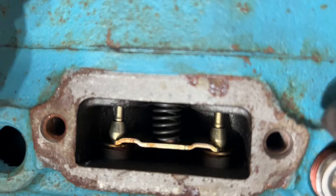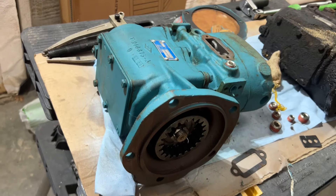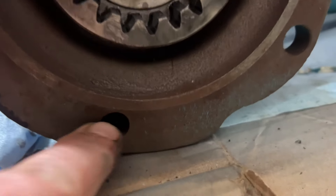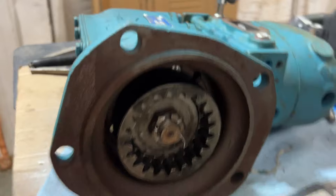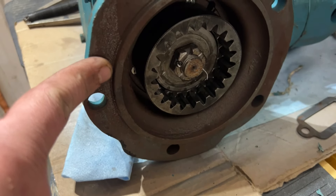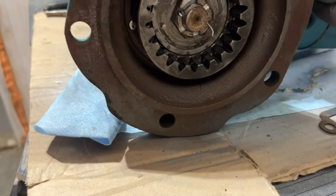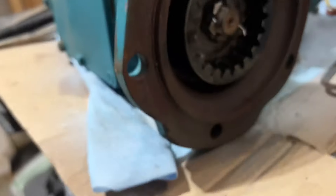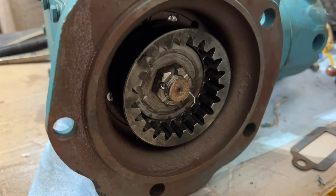That's what the unloader is supposed to look like. When this compressor is installed, it lays over on its side. There's an oil drain hole here — that one's not a bolt hole. It looks like there's a bolt hole pattern on the gasket, but that one's the drain hole. Because this one lays on its side, it's on the bottom. If you used a different orientation that went vertically, the oil drain hole would be in the wrong position, the motor would fill up with oil, and oil would come out from everywhere. So you've always got to make sure of that. Never use Permatex on this gasket — if you plug that hole up, the oil can't drain the compressor. Too much oil gets in the crankcase and causes all kinds of problems.